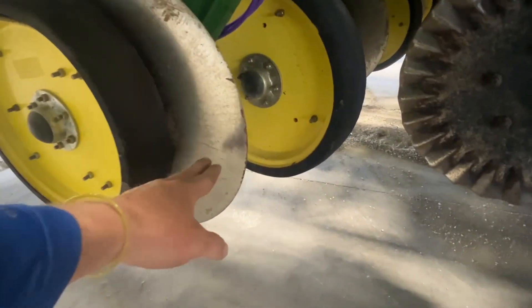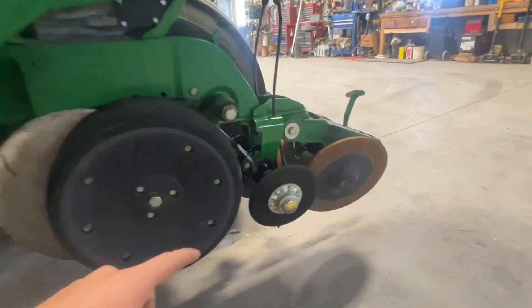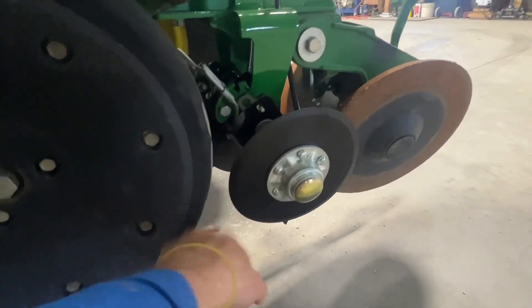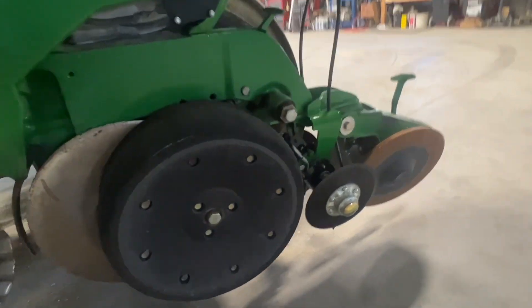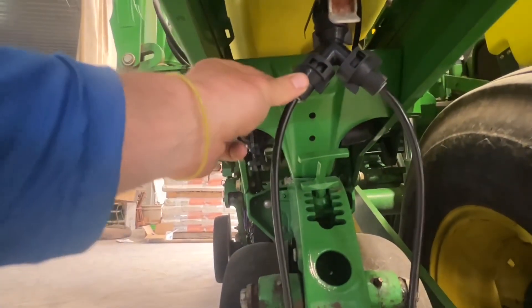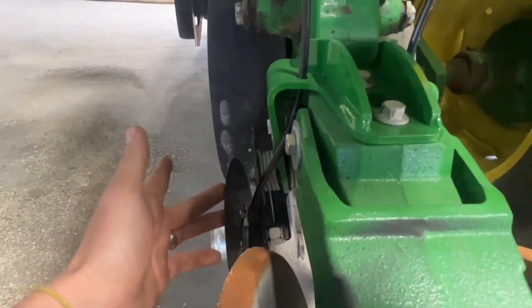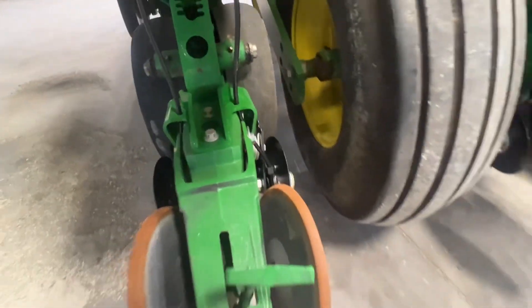He's banding the phosphorus below the soil with these John Deere single disc openers, and then he's putting a product out back here with the 360 bandits as well. Those are running with the Y-splitter and we've got our orifices housed right up in here. You can see the bandits mounted right there with the spring adjust on those.